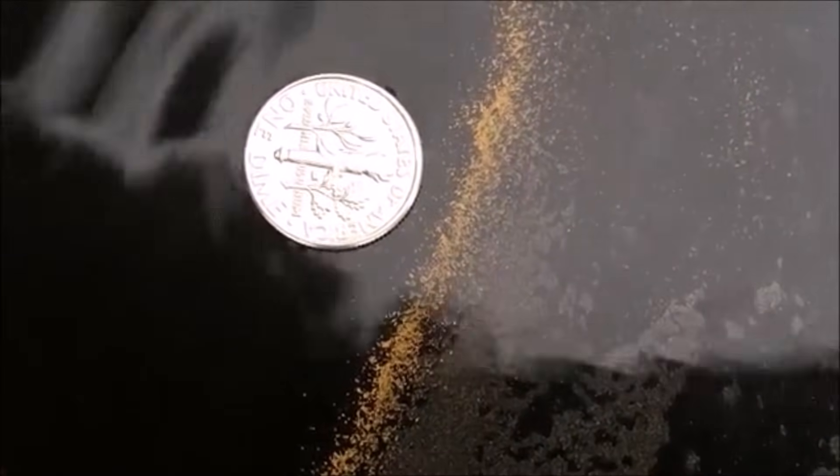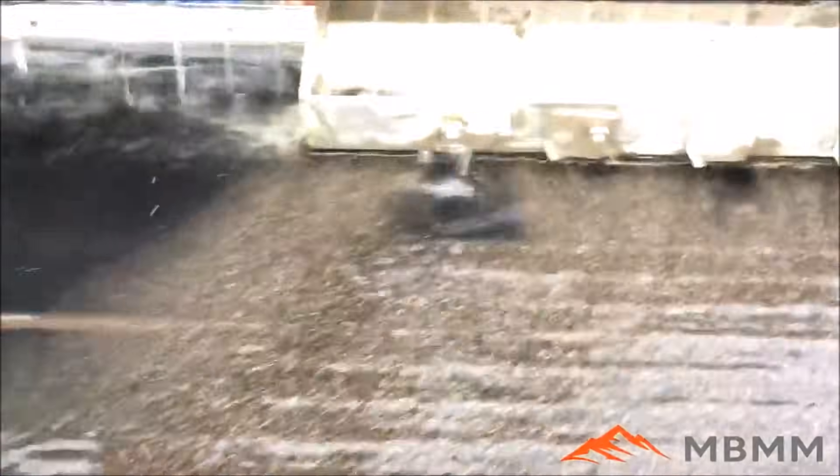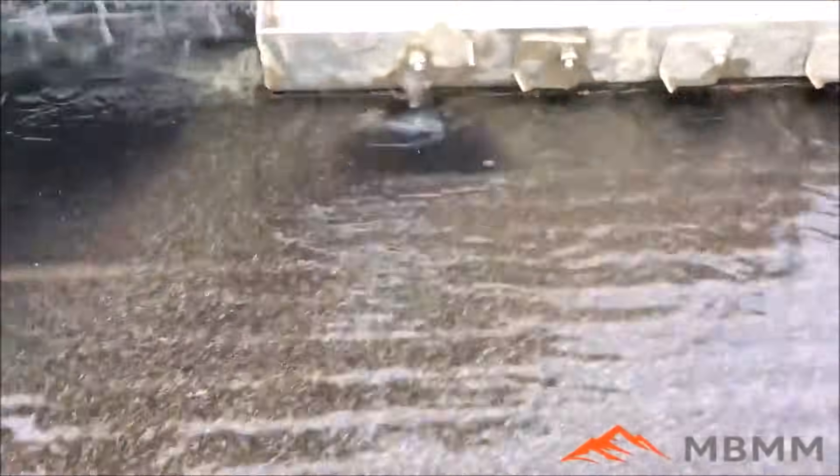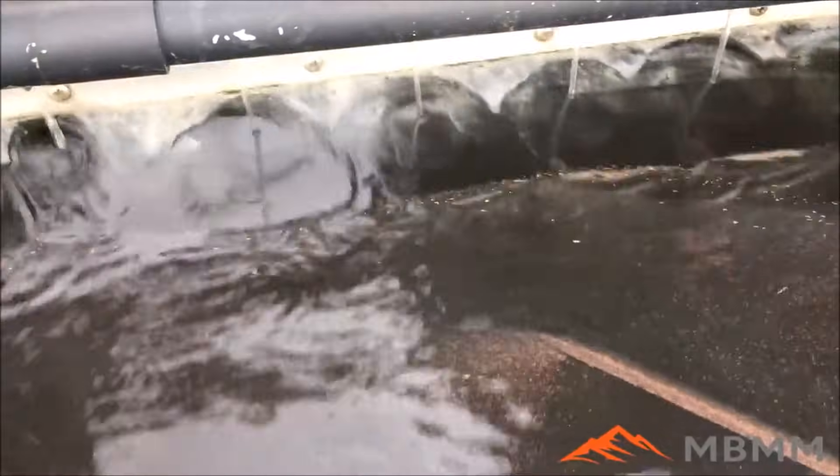Right next to a dime, you can see the scale. The red material is garnet — that's the stuff he's been fighting. It's amazing how the table separates it because it behaves similarly to gold when you're panning — it's really hard to get out. There's fine garnet coming in here, and there's a little gold flake right there. We're going to watch that and see if it comes across. There are two grooves at the bottom of the table — we call them the safety grooves.